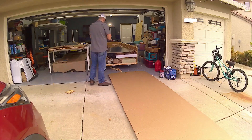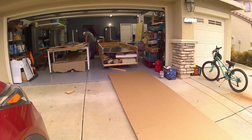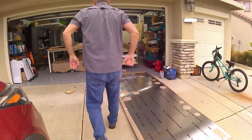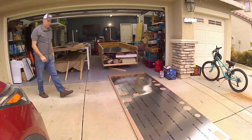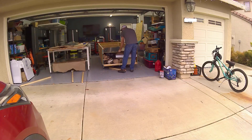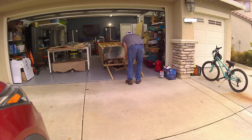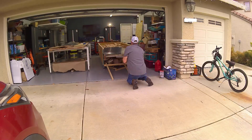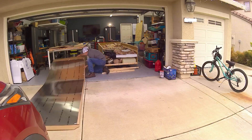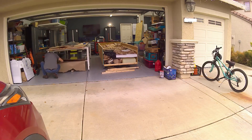You have to be really careful not to bend your wing skins — they're super expensive and really delicate. I should have had a second person here. I was able to slide them out onto cardboard I put on the ground and shift them over to the lower part of the shelf. Once they're riveted into the structure they're really strong, but you don't want to bend them in two directions at once, otherwise you'll crease them — that could be an expensive lesson. Alternatively, I've seen others roll them up lengthwise for storage. I stored them flat underneath the workbench.